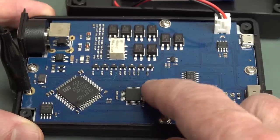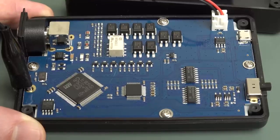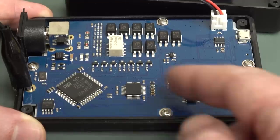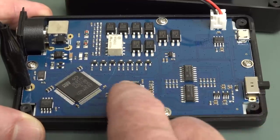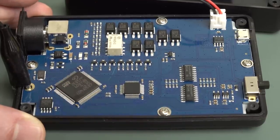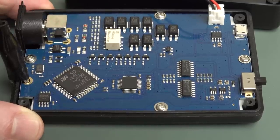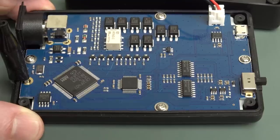So obviously it needs both of the ADCs in there to get the highest sample rate at the highest time-base settings. But even then, it's definitely not 500 meg samples per second. It's only 125 meg samples per second. But with your dual ADCs, you can interleave those to get 250. But like, how it's getting the throughput of the data into the SRAM at this sort of rate. And of course it's got nowhere near the 128K of memory, even though this thing has 196K of SRAM inside of it. But yeah, it's the most rudimentary system you can possibly imagine.